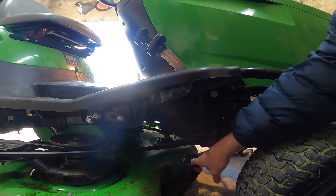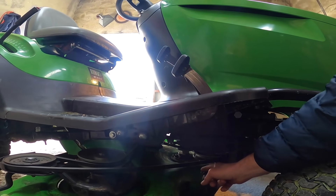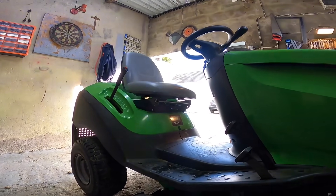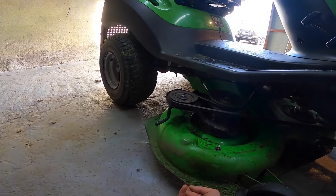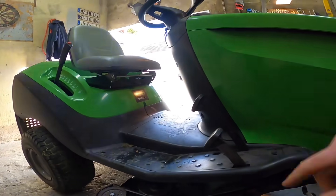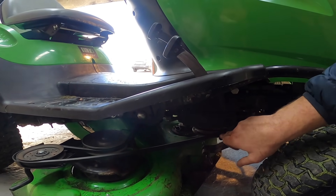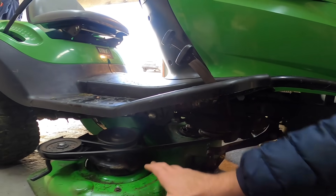How you get a deck off one of these: you have little pins here — one there, one there — and all you do is remove the little clip on the front of those pins and pull the pins out. But before you do that, lower your deck down to the very bottom so the deck wheel is basically on the ground, then ever so slightly lift your deck just to take that little bit of tension off it. Put a little bit of timber on both sides to take the tension off. Then pull out your four pins on both sides. Next you'll have to pull your belt off the front pulley — the one attached to the engine. That's the only one you have to take off, and then your decking will just pull straight out.